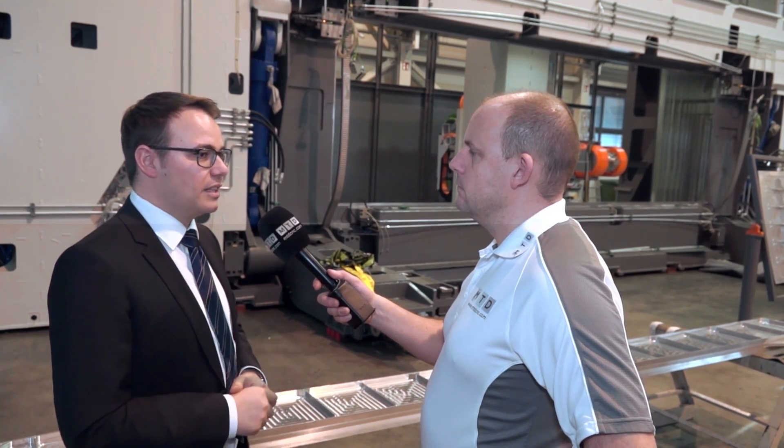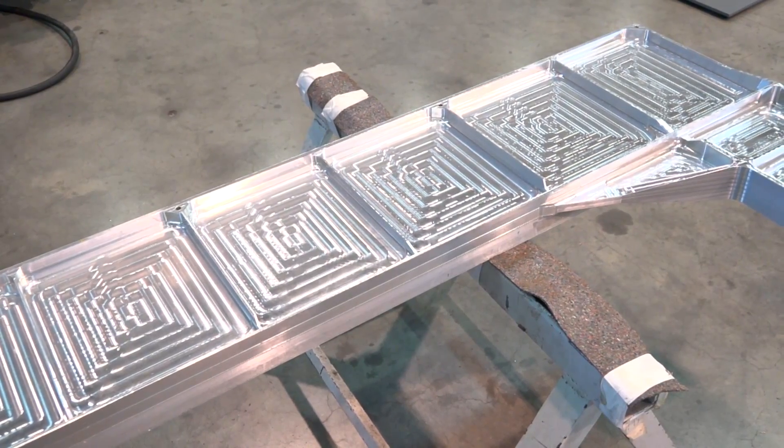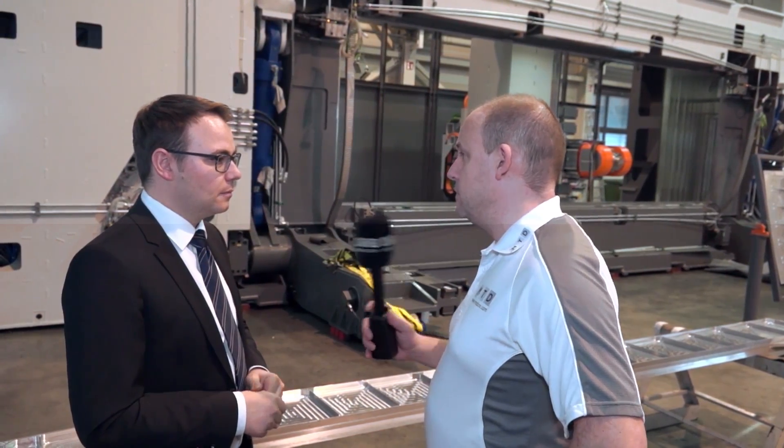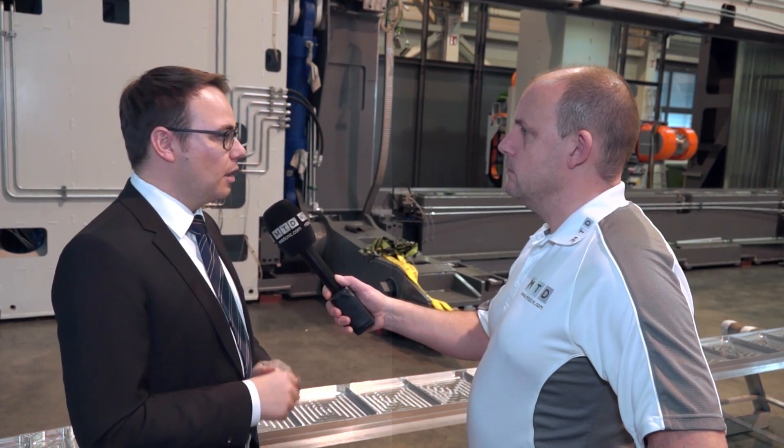It's one solid frame, and it's critical when machining parts for the aircraft industry to maintain tolerances and accuracies. At the speed this machine moves, is it able to machine to accurate precision results? We have direct measuring systems on all linear axes and the rotary axis as well, plus temperature compensation with different sensors in the machining area and on the machine frame, measuring the surrounding environment, which is compensated in our linear axes.